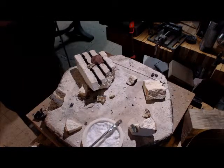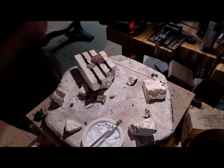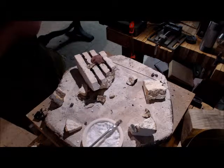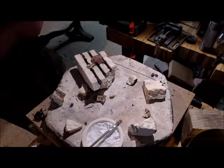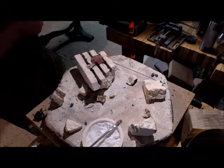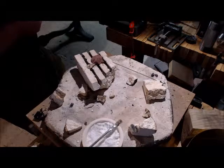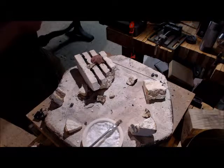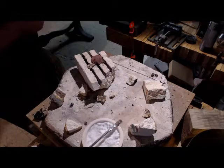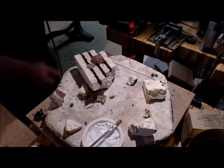A professional would say that your goal should be to use as little flux as possible, and that's why they came up with all of these high-tech fluxes that emit massive quantities of fluorides. To me, a little extra time in the pickle or a little extra time on the buffing wheel or on the grinder or sandpaper isn't such a big deal. The most effective flux I can find is borax and maybe boric acid. The high-tech fluxes that leave a cleaner finish when you're done don't work quite as well as a flux. There are trade-offs, but that's just how I roll.